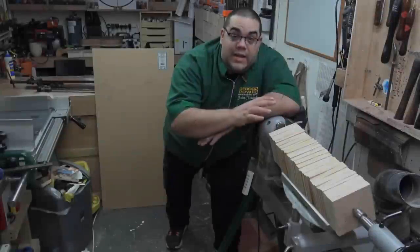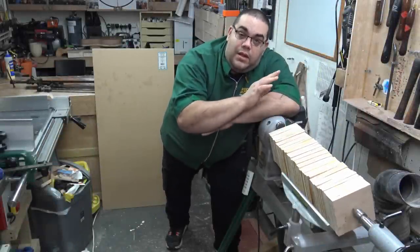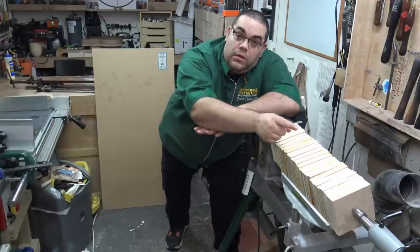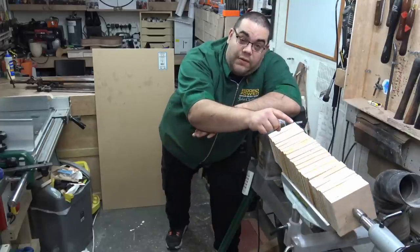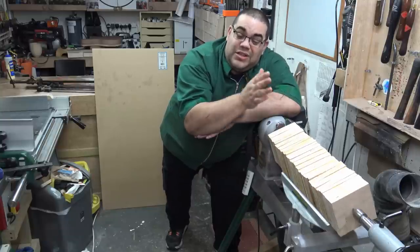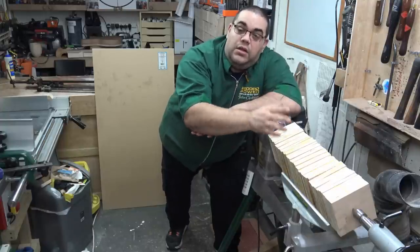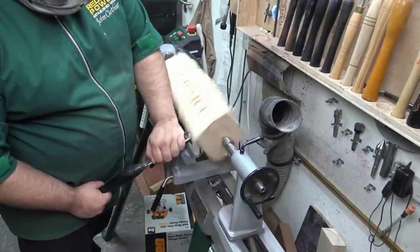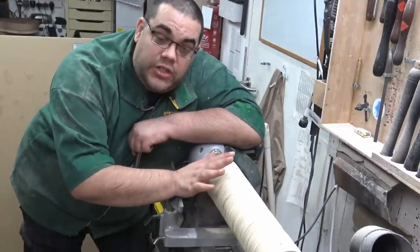Right, so it's the next day and as you can see I've removed the clamps and attached it to the lathe. It's a little bit wonky so I'm not going to end up with quite as big a diameter drum as I was hoping for, but that's okay. I've got the tailstock holding it for support, it's rotating freely. I need to drill a hole in that end for the support when it's going to be used, but I want to true it up first — just to make it more in balance and stand less chance of it wandering as I drill the hole. Once that's done I will true it up again.